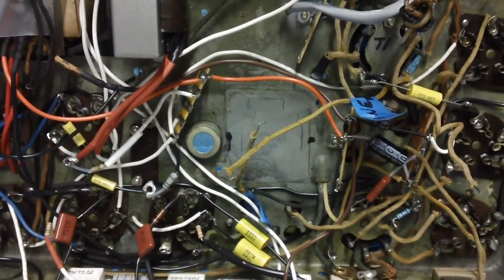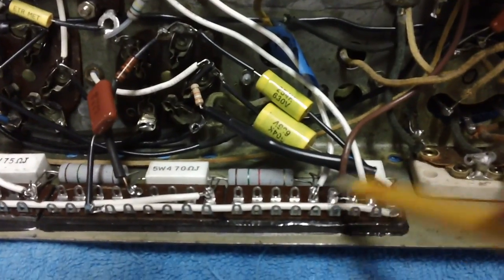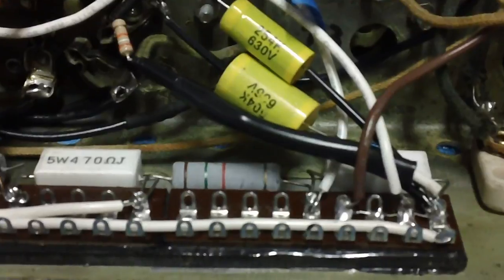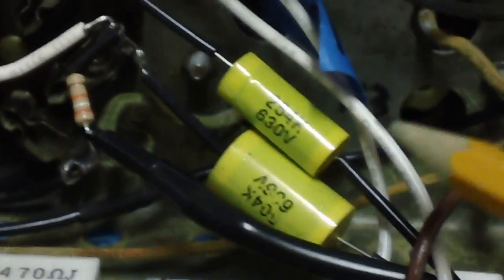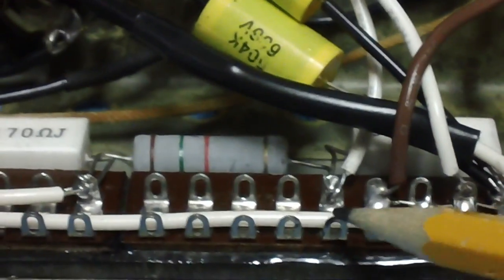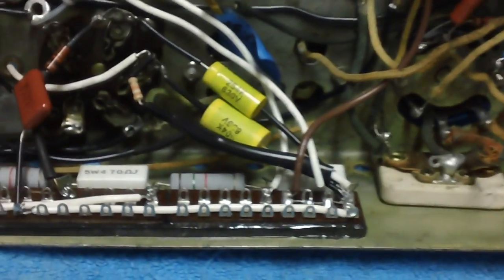Also, before the next video, there's a wire right here. This is really stupid. I don't know why I put that on there like that. This wire right here, I should have taken it over the top of these wires, brought it down and soldered it that way. As you can see, it's way too close to that ceramic, that hot resistor back there. I don't know how hot that resistor is going to get, but we got to get that thing out of there. It's just way too close. Okay, so we'll bring it over the top of the wires and then solder it.